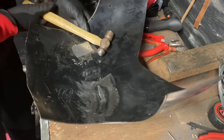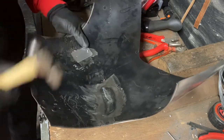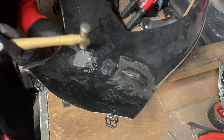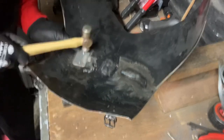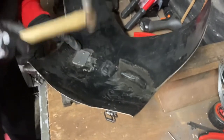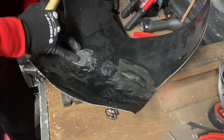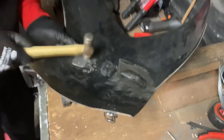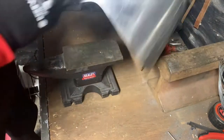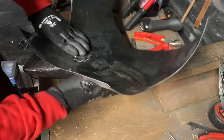What we have here now is the breastplate on the anvil. The rivet that we've just made is pushed through the plate and what we're going to do is use that flat on the anvil, try our best to get the best angle, and we're just going to rivet this over gently. We don't want to do that rivet up too tight until we're happy with the position of the other hole, so I'm going to leave that and get the second rivet in. Then once it's tight, that's what you're left with on the outside — a nice rivet head.